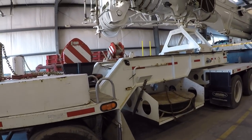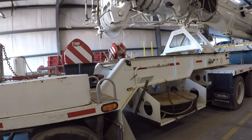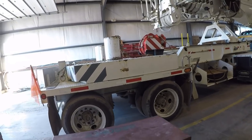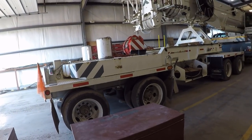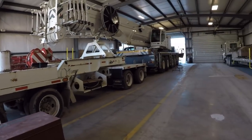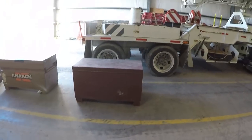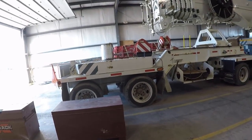that boom has a lot of tail swing. So if I were to turn a hard left turn with that boom tip sticking out, without exaggeration, that boom tip would be about where I'm standing, which is about 15 feet outside that dolly.